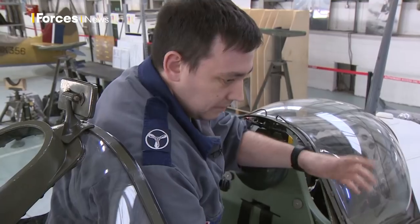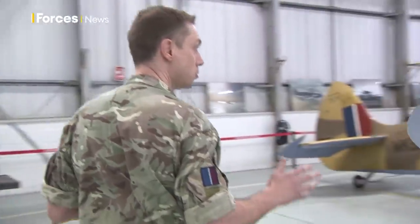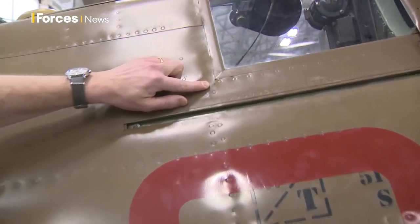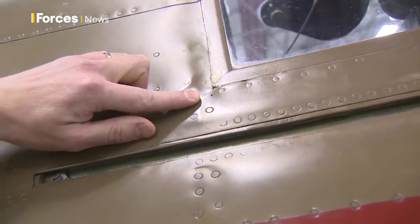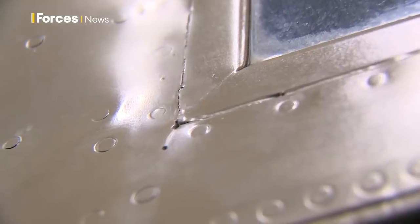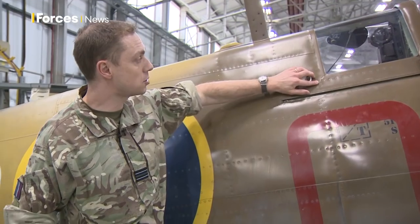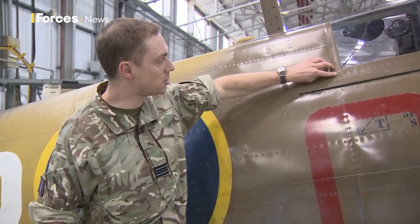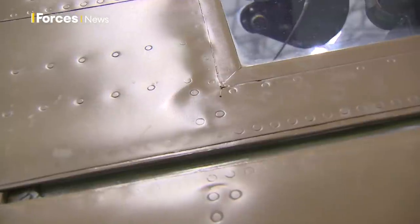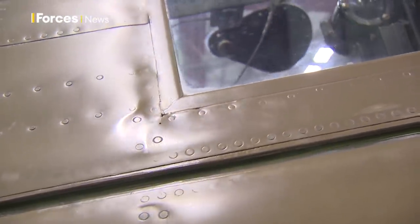If they're loose when it goes to move the controls, it might not move. We inspect and maintain this aircraft to a high degree — really into the detail. We can't fix everything in all honesty, but everything we can't fix we take really seriously, even down to the finer details. Bear in mind this aircraft is a historic aircraft — it's old — so we really need to look after her. It may seem like a really minor crack, but what we're thinking about is: can the crack propagate, can it cause an issue to the pilot, is there a risk to safety? We do this on the whole aircraft. We have something called a stop drill — we're trying to stop the crack from propagating. There are cracks over the fuselage, but because we do a multitude of inspections they're all captured.